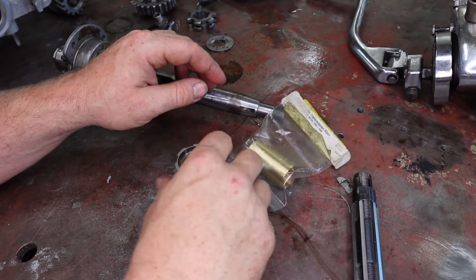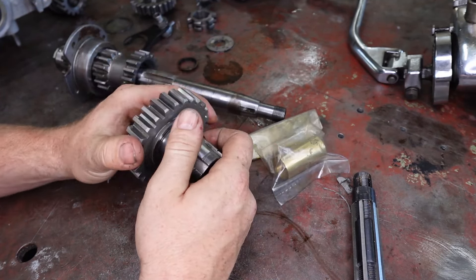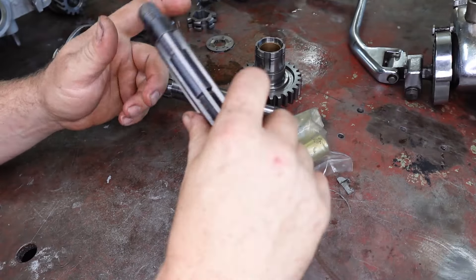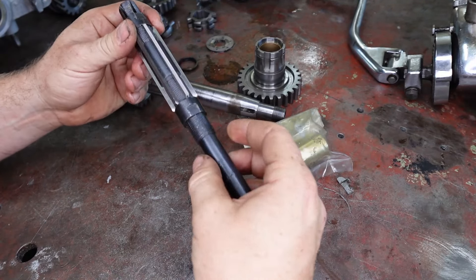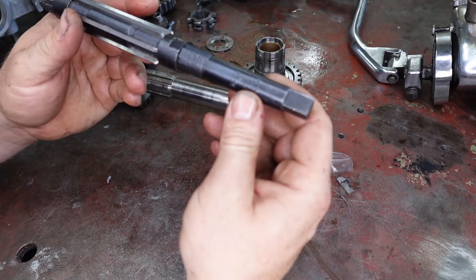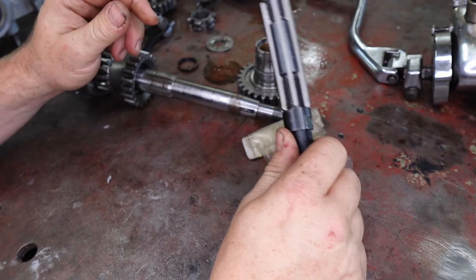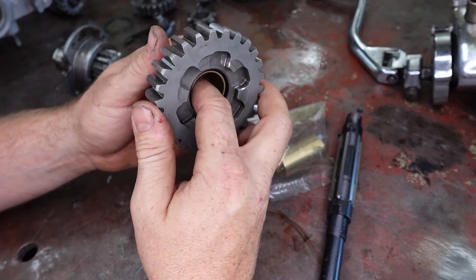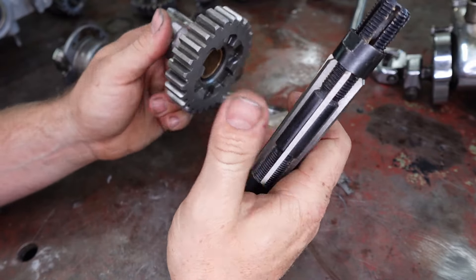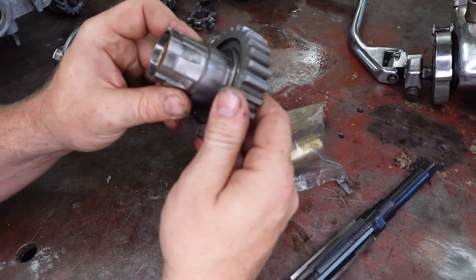It's just a solid style like this. When you press this bush out and press the new bush in, it's going to be undersized — they make it like that so that you can size it yourself and size it perfectly to your main shaft. You're going to need one of these — this is just an adjustable ream. You can get this from pretty much any machinery or tooling shop. This is a 15/16th to 1-1/16th adjustable ream. You can do this with just a little hone, but this gets you a better fitment and makes it nice and square.